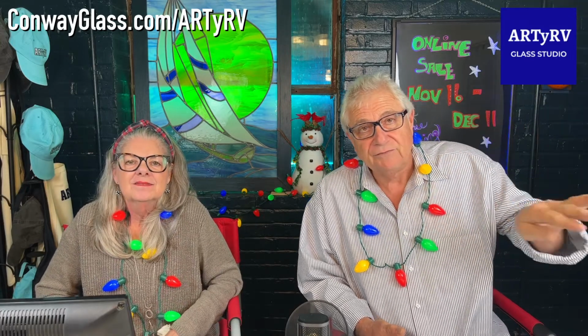We appreciate everybody. Magali said, since you mentioned rebar, when would you need to use rebar? On a window, I would say probably maybe 16 or 18 inches wide and 3 foot tall, you would just want to put some reinforcing in it, maybe not straight horizontally, but run it from one side of the window around things and run it to the other side. This will give it that flexibility. It'll take a little bit of that flex out of it. And I think that would be a good idea. Anything over maybe 3 square feet, you should think about reinforcing it in some way to keep the structural integrity of the window itself.